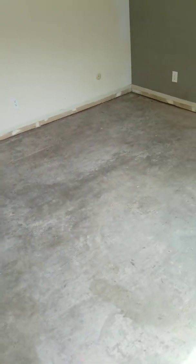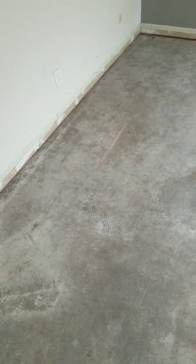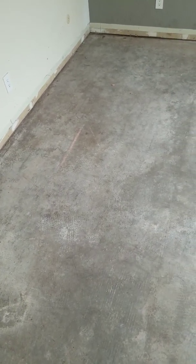In the case of this house, I don't believe we have a pressurized plumbing leak, because first of all we would see it in the water meter, and secondly we would see damage in this slab wherever it's leaking — you would see the water coming up. There was so much of a moisture problem, I think it's something that would be obvious. So it's not just some tiny pinhole spraying a mist — there's a lot of water coming up through here.